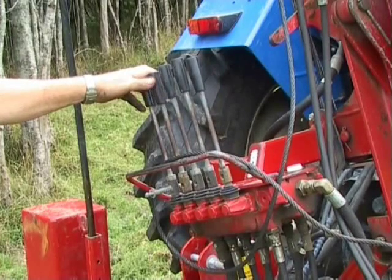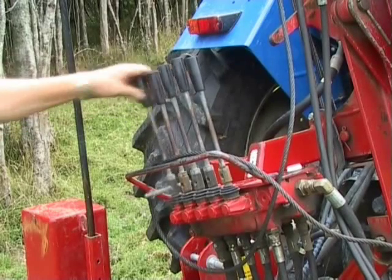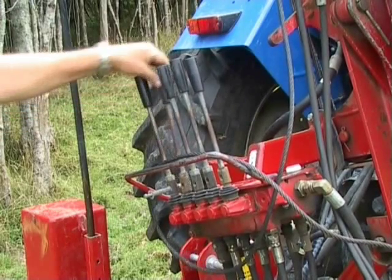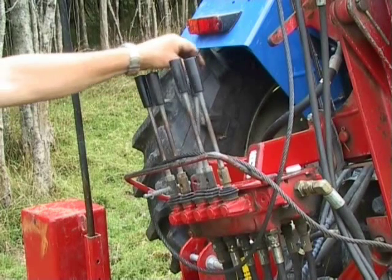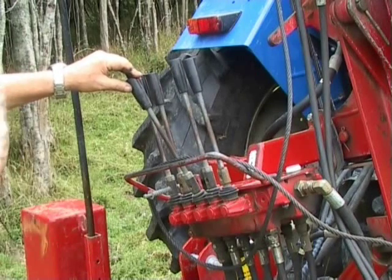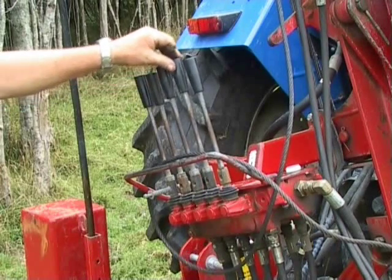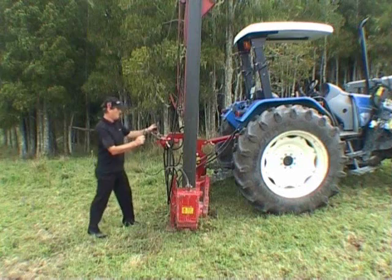The Series 3 comes standard with four hydraulic banks. Firstly, the hammer. Second is for the top link adjuster, forward and back. Next, the angle adjustment, left and right. And then the side shift, 18 inches to the left and right.